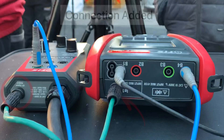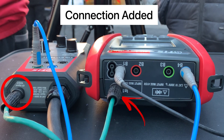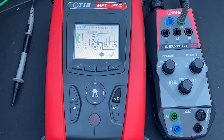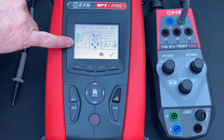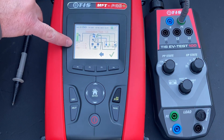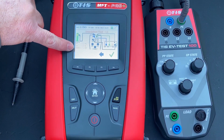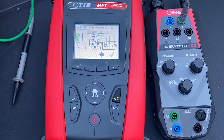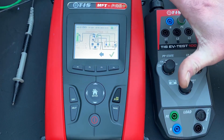The cover's back on, so we shouldn't have to go back in there again. We saved the continuity result and now we're on to the insulation test, which is next in the sequence. The dials remain the same — PP NC, CP A, fault status clear. The only change is we now introduce a new lead; this is the only time we change leads from the continuity test. Once this lead configuration is done, we never touch them again.